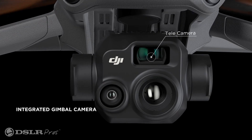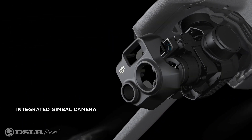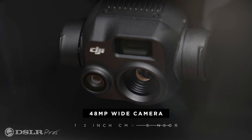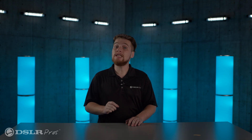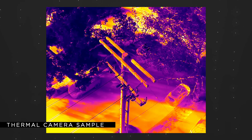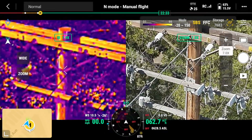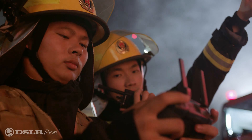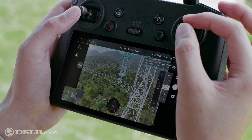Now, on to the Mavic 3T. The T stands for thermal. This payload has three sensors. It offers the same telephoto sensor and lens as the Mavic 3E, but the wide-angle camera differs. It uses a much smaller half-inch sensor, but with a higher resolution of 48 megapixels, so while still offering excellent clarity, it does lose the mechanical shutter, which makes it more susceptible to motion blur during mapping missions. The thermal camera is a high-resolution 640x512 that offers simultaneous zooming side-by-side with the visual camera from 2 to 28 times. If you have the need for a thermal camera, this is the version to get. For scenarios like firefighting, law enforcement, search and rescue, and inspections, this is a must-have payload.